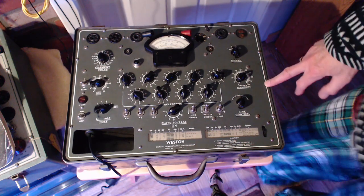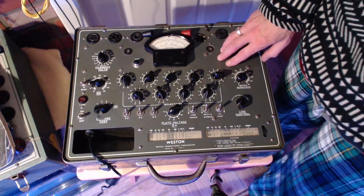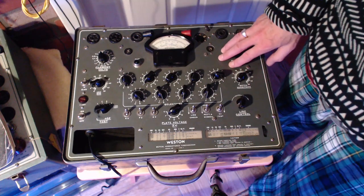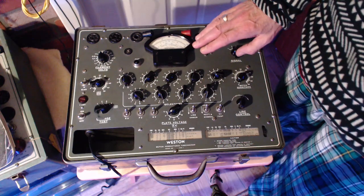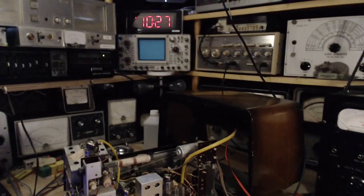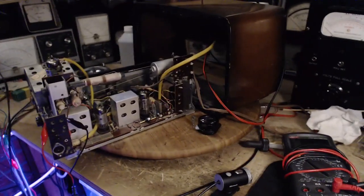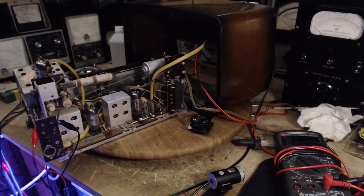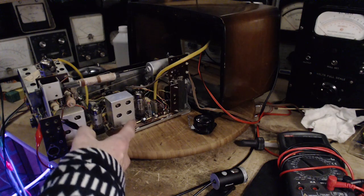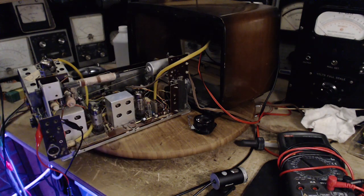So quite clearly you can pop a 6AQ5 in where an EL95 was. But problems will ensue. And that's what I want to try to work around. I'm going to assume maybe the low volume in the radio was due to the defect in the 6AQ5. The interesting thing is, when I tested the 6AQ5 as an EL95 by accident, the short didn't show up. So it's just possible the short in the tube may have no impact on this radio, but in another radio that shorted tube may cause a problem. I don't know. I'm going to think a little more about this before I do anything.